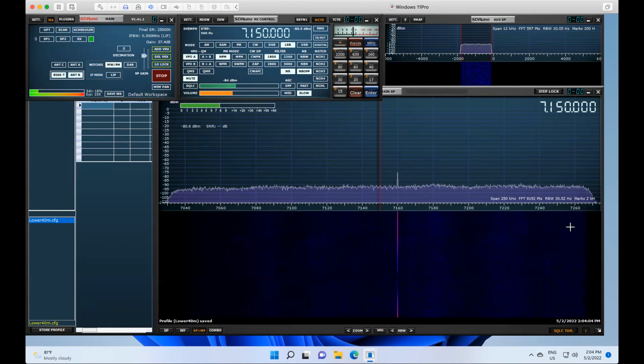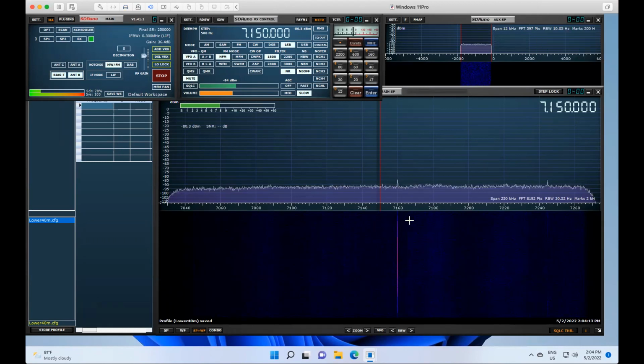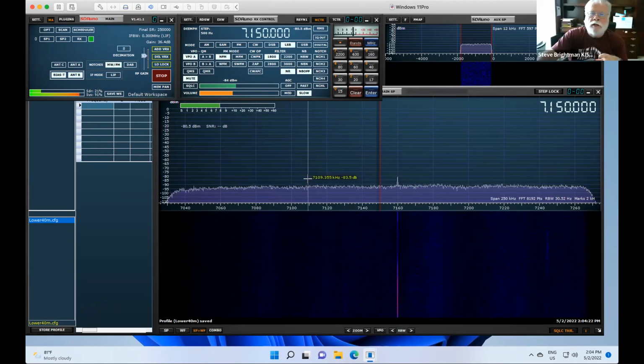So are you telling me then that I can use the preset bands while I'm doing a scheduled recording? Yes. Okay, that's confusing to me because the scheduled recording also wants me to specify the frequency that I should put in there, but that sounds like it's, yeah, go ahead. That is when you do a scheduled recording, that's going to be your VFO frequency. Okay. So if you wanted to, for example, just make an audio recording of one particular station on the hour, you would specify that frequency there.